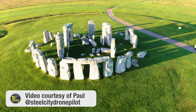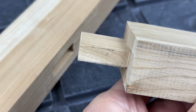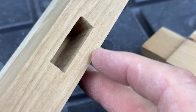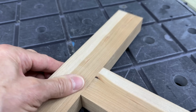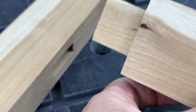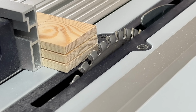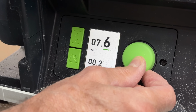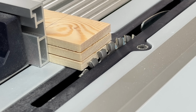Mortise and tenons can be used in pretty much any piece of furniture, and like the bridle joint, the end of the rail is cut down to around 1/3 of its thickness with a corresponding mortise cut in to accept it. There are many variations on the mortise and tenon. This is a stub tenon, so it doesn't go all the way through, and the tenon also has top and bottom shoulders cut to it, all the better to hide my shonky hand-cut mortise. The tenon can be cut by any of the various methods we'd also use for the bridle joint, but the mortise needs some extra care, either drilling it out and finishing up with hand tools, using a router, or a dedicated mortising machine if you have enough of them to do to justify it.